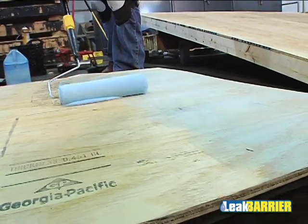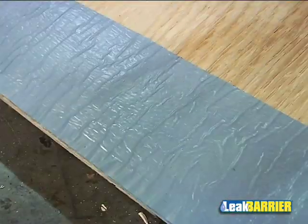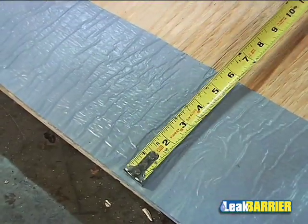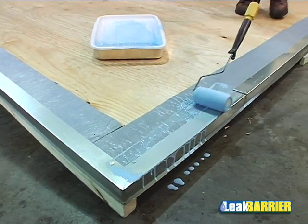It is very important to wait until the primer dries before installing the underlayment. Cut 6-inch wide strips of PS200HT or PS200MU underlayment and apply the strip to the substrate prior to installing drip edges and L-metal counter flashings. This step will ensure that all metal flashings are sandwiched and provide an effective seal. It is necessary to prime all metal flashings with the recommended primers.